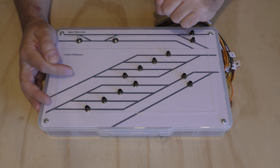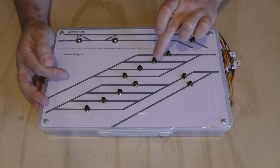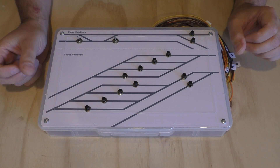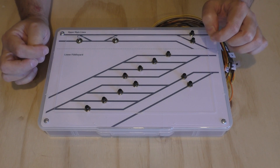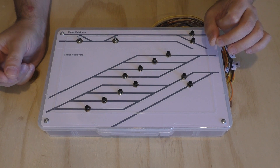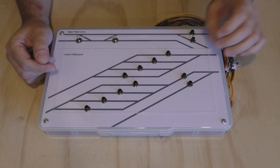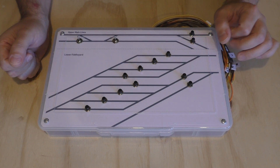For each of these buttons, the idea is that they will control a series of points in order to activate that particular route. I originally assumed that if I push a button it would simply change those points — simple as that. But on closer inspection and doing a bit of research, I realized that pushing a button could actually send a signal to both sides of a coil on one of the points, or possibly even more than one point — sending current to both coils simultaneously. We don't want that to happen. It's simply through the wiring of hooking up multiple point motors to the same supply that you run into this issue.